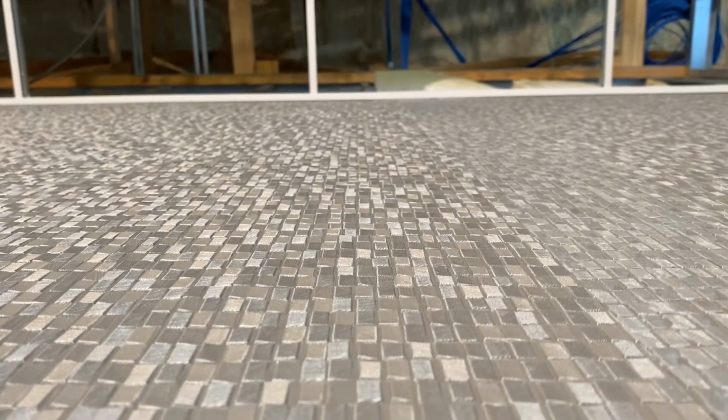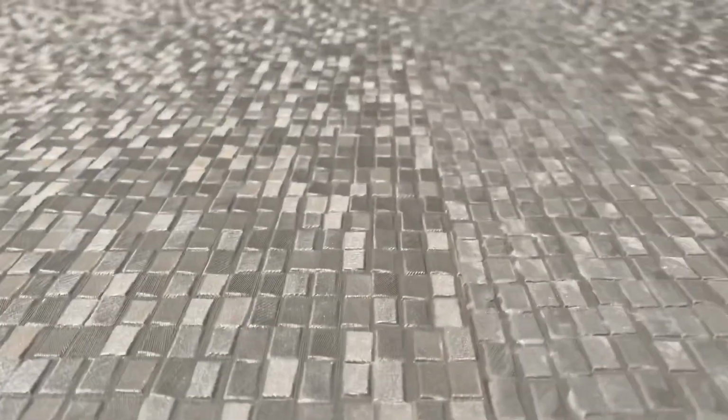Okay, now you want to really check your seam? Put your head up against your wall covering and look down. Put your head up against your wall covering and look up. That's how you want to check your seam. You don't want to check your seam stepping back, looking up and down. Once you don't see any humps, looking down and then looking up, the second thing you want to do is go to the side. Do you see anything?